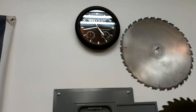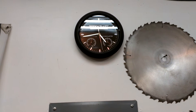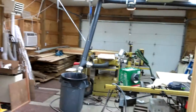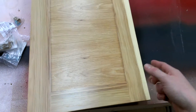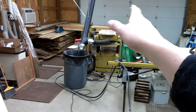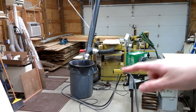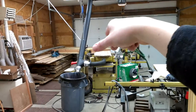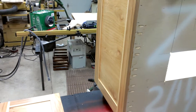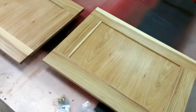What I like doing — it's cooled off in here because I had the garage door open packing in 18 sheets of drywall — but what I do is I turn my heaters on full blast when I'm finishing and get it up to about 90 degrees in here, and it dries the stuff just like that. You can spray the doors, spray the drawer front. I also bought some trim and wanted it sprayed, so by the time I sprayed this stuff I could go spray that, then do the carcass without worrying about overspray, and by the time I'm done with that it's time to spray this again. It works out really well.